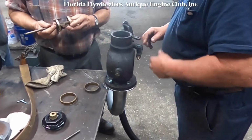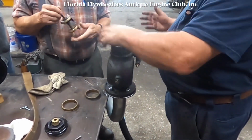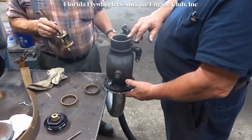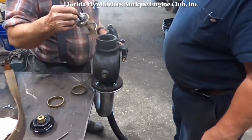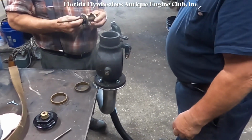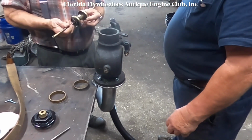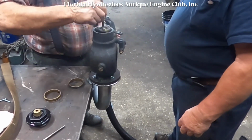Yeah, I took that off because I had to turn this whole thing. What I did is I held this in the chuck, and I stuck my boring bar out far enough to bore it in the lathe. Yeah. That was the best, because this flange is not square with the bore, and it's not round with the bore either. You think they'd have done it all in one shot? I don't know, wouldn't you? I don't know how they did it, except it seemed to work. This seemed to be concentric with the bore. Got a little chamfer there, which is what we need. Actually, on the bottom half here, not the top. We don't care about the top. And I didn't even mess with that chamfer because I only took like 12 thousandths off per side, and it was round. If that was a square angle, that thing would really kind of not know where it was at. You know?